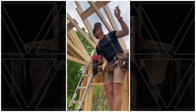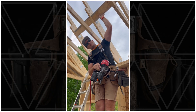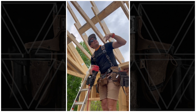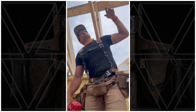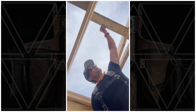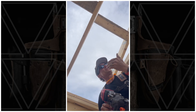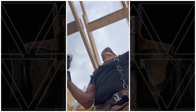Another crucial thing — ridge blocks. Mathematically they should be 22 and a half inches, but we always cut them 22 and 7/16ths, even a little less, so they butt into gang nails. They don't grow, the cuts aren't perfect, so cut them short. Worst case you put it together and you've got a bit of slop — you just space them out. It's much easier to knock things apart than to have blocks that are too long. That's the easy way.